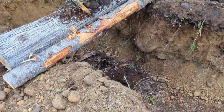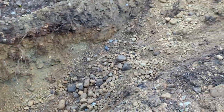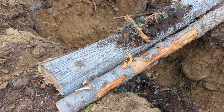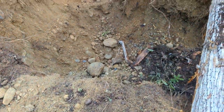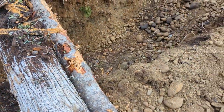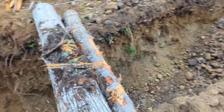So if the walls came in it would be contained a little bit, and also if it slumped down I'd be able to tell — it'll be sitting on the two-by-twelves, and hopefully if it caved in in a more dire way that would help give a little extra support and security. I'll show you how I did all that. I think it's an improvement on the government's old plan, especially since my soil type is very sandy and really given to collapse.